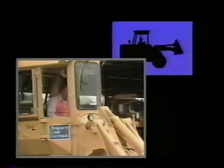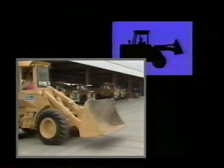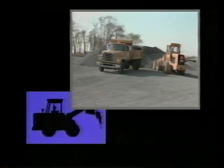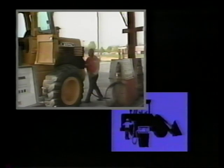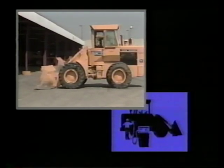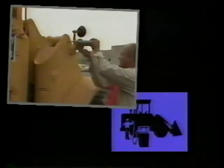The second activity is the equipment warm-up check, made from inside the cab while the engine is warming up. Be sure to read the gauges, listen for unusual noises, and test the hydraulic system before leaving the parking area. The third activity is the daily operation check. Operating checks during the workday include reading gauges frequently, listening for unusual noises, and being aware of changes in the performance of the equipment. The fourth and last activity is the shutdown check: fill the fuel tank, clean away dirt and debris, park the loader on a level surface, rest the bucket on the ground, set the parking brake, idle the engine for approximately five minutes prior to shutdown, record your hour meter reading, and grease all mechanical joints.